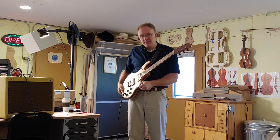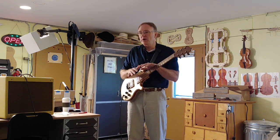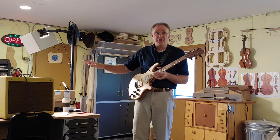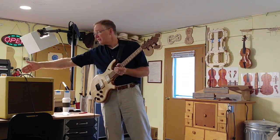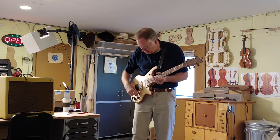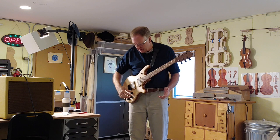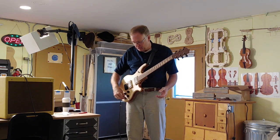So now for a more practical demonstration of how this shielding can help you in your guitar if you have something noisy like this guitar was. Right now I've got the amplifier set on just a reasonable level, which is 3s, and the tones at about 8, and the volumes are at about 3, and the volume here is all the way up, which is not usually what you want. Tones are mid-range, and if we just listen, you'll hear almost zero noise.